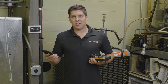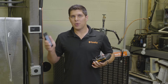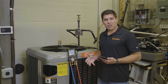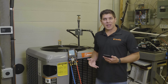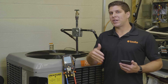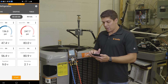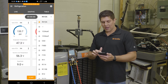With the second screen mode, you are able to get all your probes and all your readings from the manifold to the phone. Now we have the 557S connected up to a refrigeration circuit. The first thing we want to make sure is what refrigerant the system is running. I know this is R410A, and to demonstrate how quick and easy it is to select your favorite refrigerants via the app, I'm going to jump into the app and select up top where it says R410A — you'll see it brings down all your refrigerants.